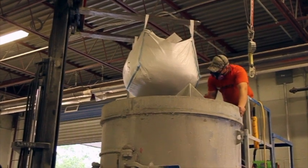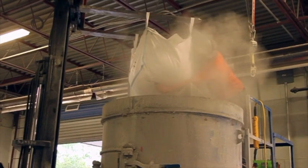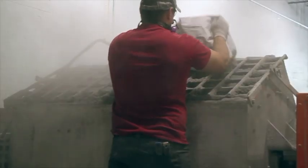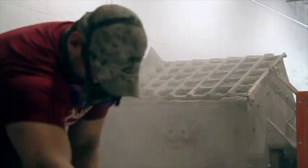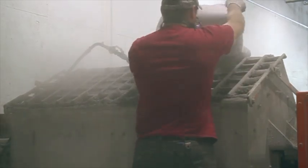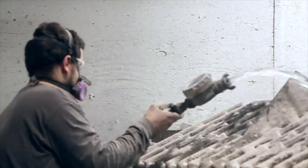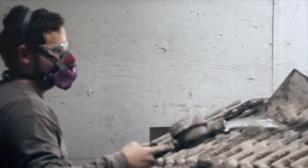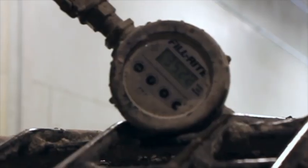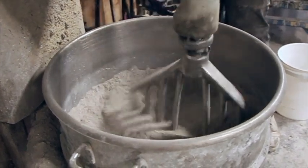Precast is one of the many refractory products Onyx offers. The process of producing Precast involves pouring and mixing the refractory materials based upon a specific percentage of water in specially designed high shear mixers. The designated amount of refractory material is first added to the mixer, then combined with water and steel fiber reinforcement materials. The mix time and water content are based upon the engineering standards required for each product line.